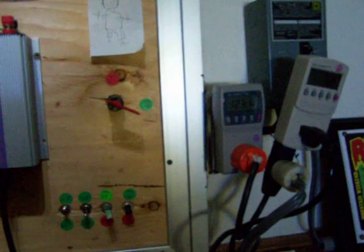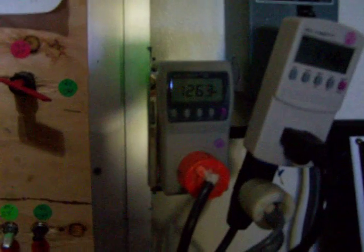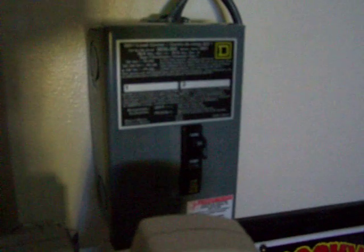Alright guys, I just figured I'd give you a little something to watch. I think I gained about 150 watts with that new grid tie inverter outside. The AC line that comes in from the yard goes through here, through here, comes up through, and goes into this breaker — I think that's a 30-amp breaker. Then the line from that breaker goes right out through the wall, through this conduit, through another wall, and it goes right out into a 30-amp breaker in my main fuse panel.